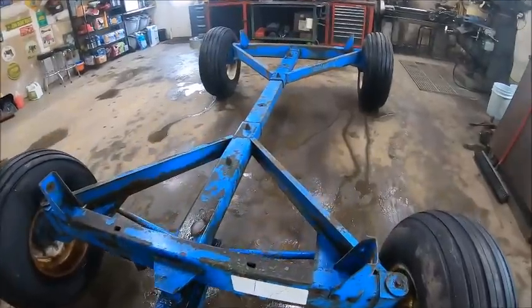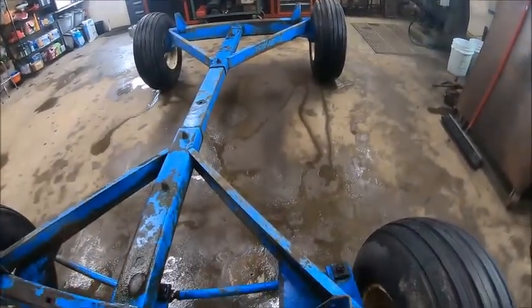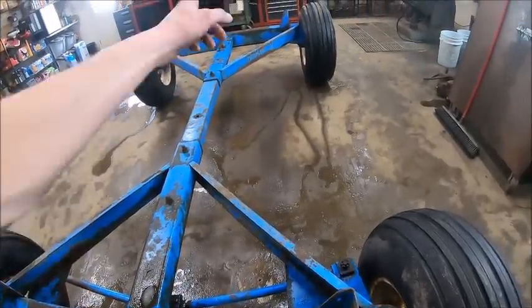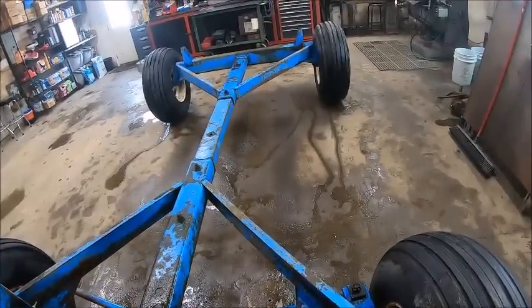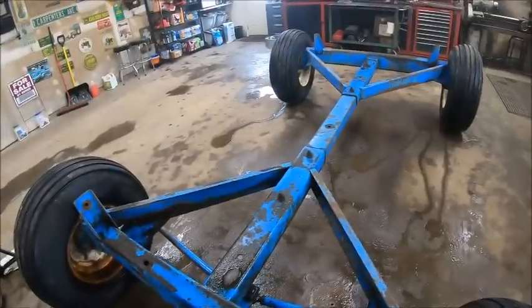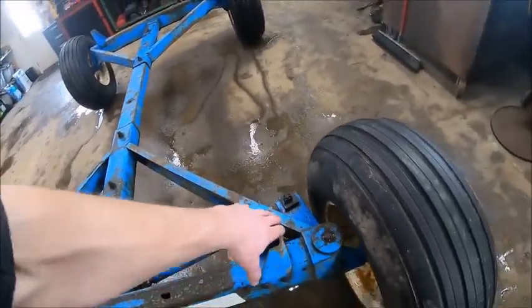I went down and measured the cradle for that thing, and the cradle measures 112 front to back, and the reach right now is set at 106, so I'll have 6 inches of overhang. Plus, I think, I didn't measure the tank. I think the tank overhangs like another 8 inches. So the overhang will be perfect. I'm not gonna move the reach any. We'll have to move the stakes.